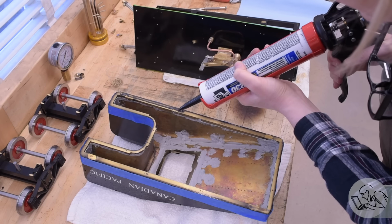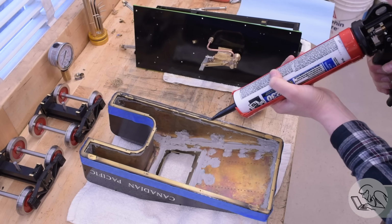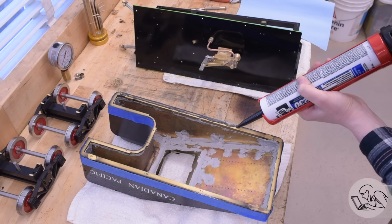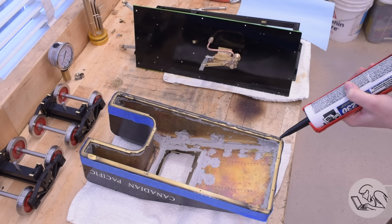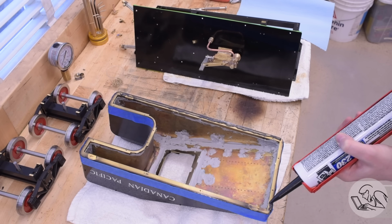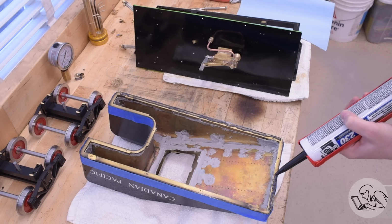I kind of borked it up on the belt sander a little bit, trying to get some twist out of it. I ended up cupping the bottom surface a little bit. So it's too curved for a gasket. It's not flat enough for a gasket, so it needs to have some sort of silicone or other more aggressive sealant on it. My patrons had lots of good suggestions for this, including butyl tape and RTV and combinations of grease and RTV and various marine products and so on.